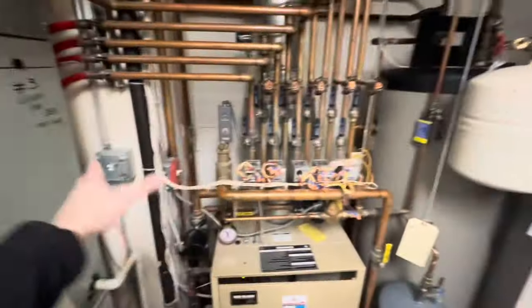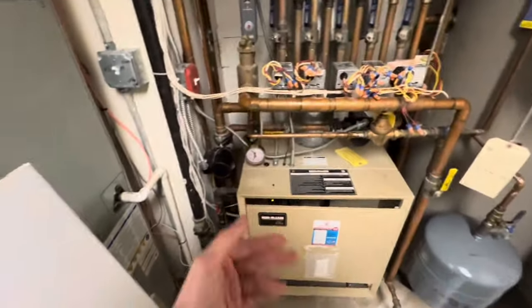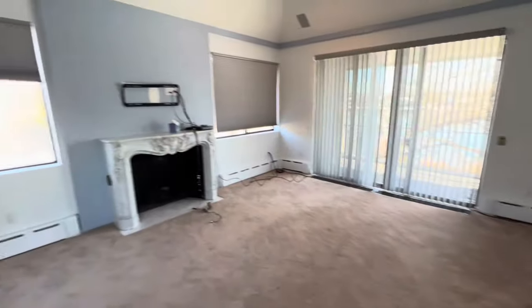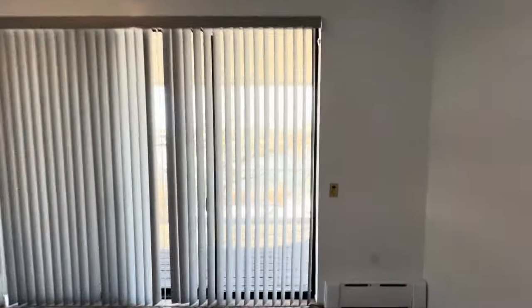Our new one is in. We verified that all our zone valves open and they make end switch. You can see we only have a few zone valves calling open and everything is working properly. Boiler's at temperature, we're circulating hot water throughout, and we are good to go. I'm back in the massive house on the water.